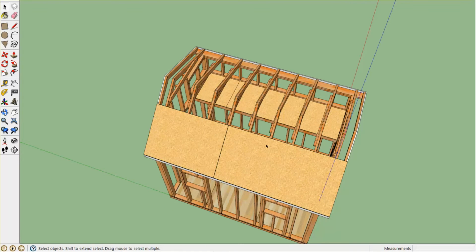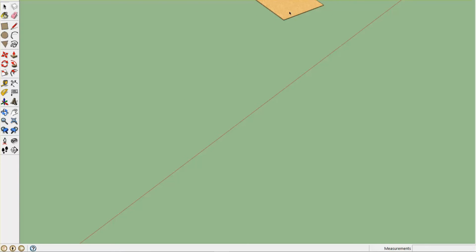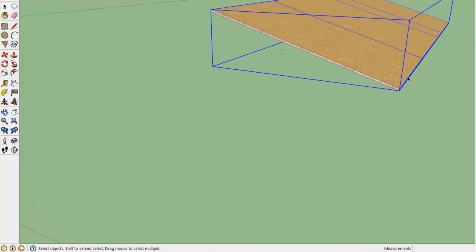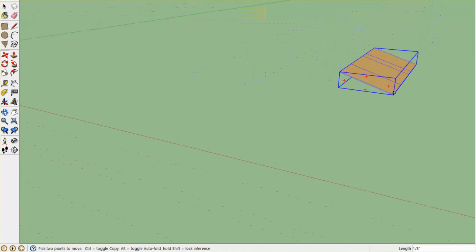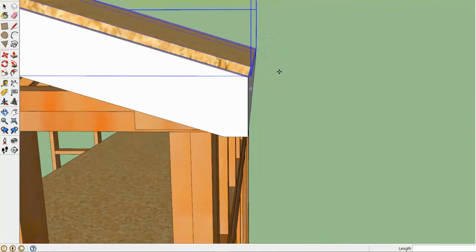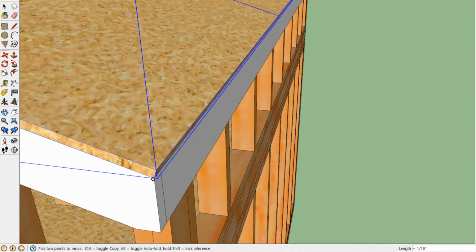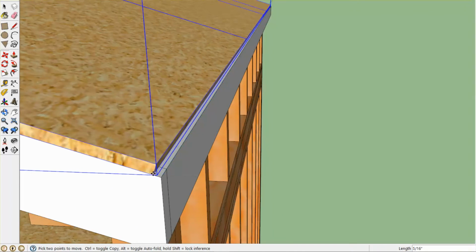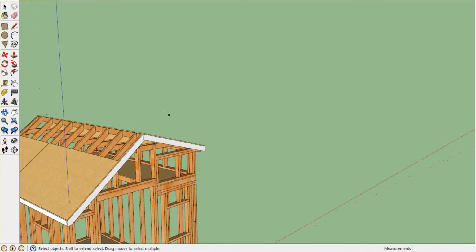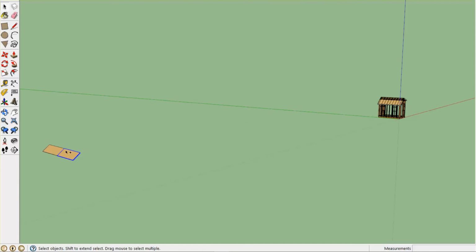I think this should stay now on this side, and you should put the other side on. I've already got that all cut. These we're going to use in the 48 inch direction. I think it'll just work out better that way. Again, cannot extend out past the fascia. Got to scoot that thing up a little bit. There we go. Make sure that we're not over the peak. Get your last pieces on there.